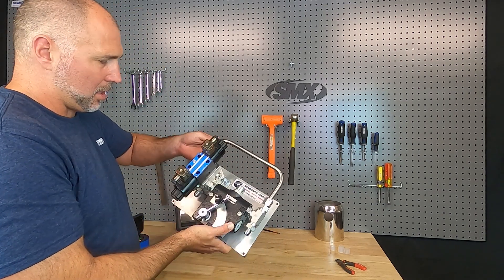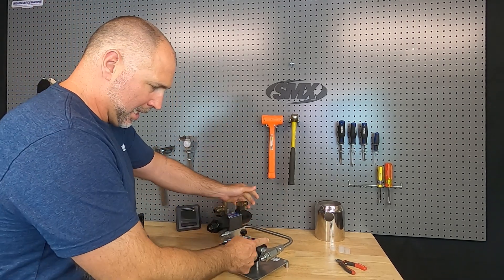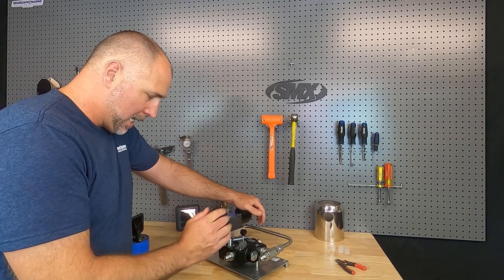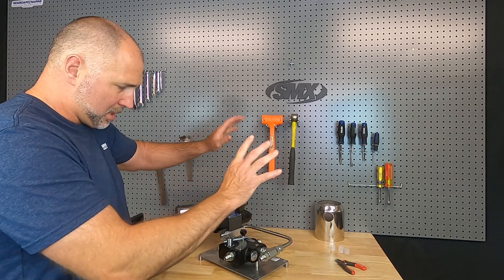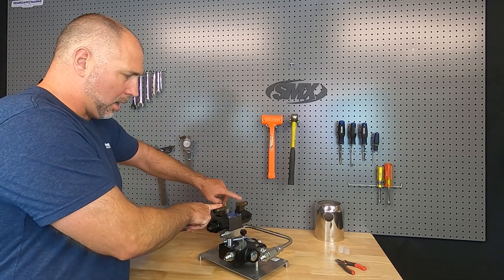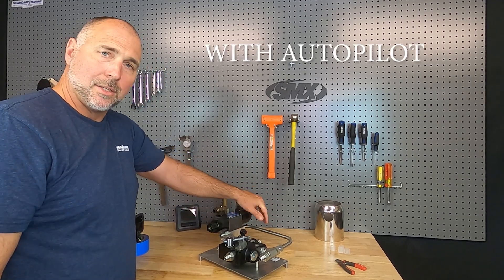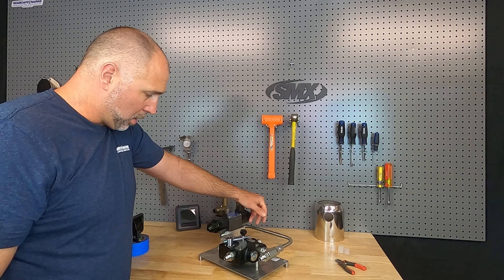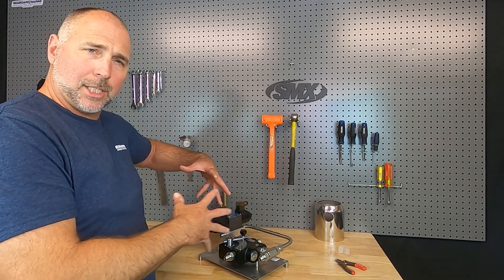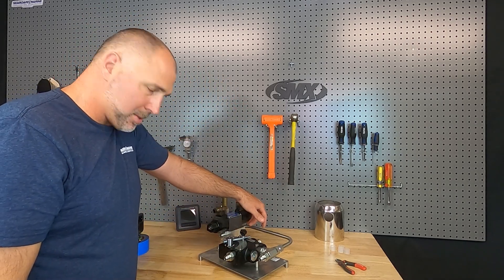It's a great little unit. It's all engineered with a nice mounting plate, and it's all plumbed with a common input and return to tank, so it makes your life easy. JIC number eight fittings. Bolt this up to a bulkhead or anywhere down in the engine room, hook up a few lines, run your autopilot 12-volt to the solenoids, and you've got power steering and you can tune it right to whatever you want. Tim is going to go over the specifics of how this connects and how it would integrate into a standard power steering system in most vessels. Stay tuned.